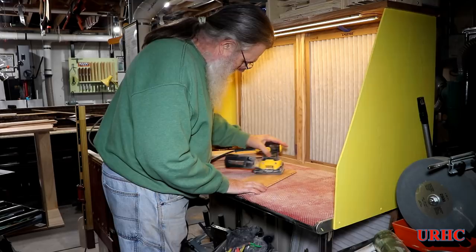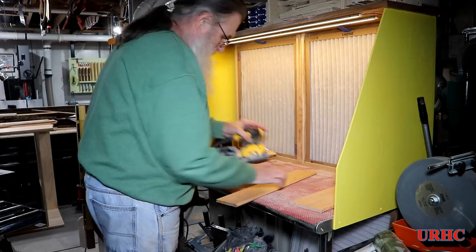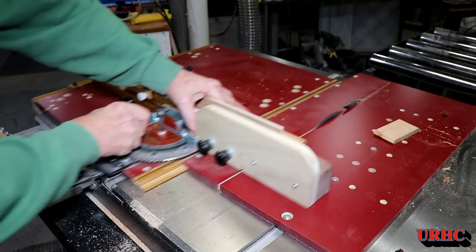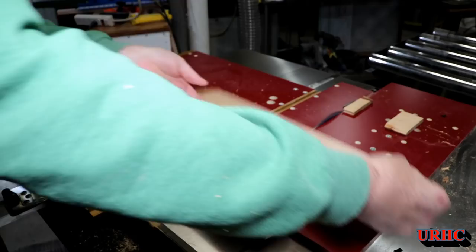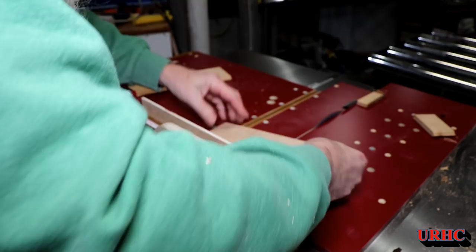Time to go back and give everything a good surface sanding to get it prepared. My planer's carbide inserts — a couple of them are leaving streaks through the board pretty bad now, so I'm just sanding with about 120 or 100 grit paper to get rid of those marks. Then it's time to go over and start cutting them to length — first I'm going to do the bottom pedestal and wrap that with these pieces.